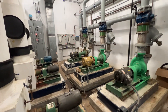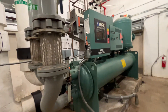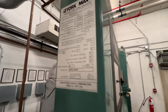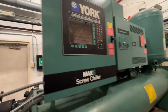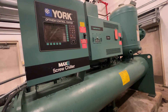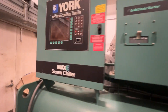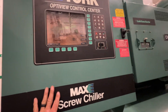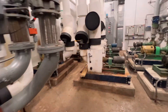Going back to the plant — these are two York screw chillers, some YRTCs. Someone commented they found out they're 240 tons. I have them both off right now because there's nobody in the building — it's an unoccupied day, light load, and I don't need the noise. So we've got dueling chillers. Maybe some of you guys don't know, but this is our energy management system — these Andover Controls here. It's building management.